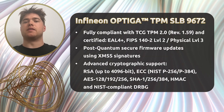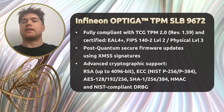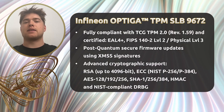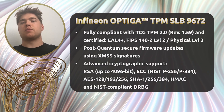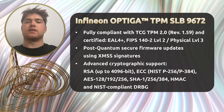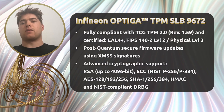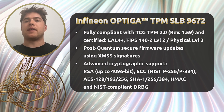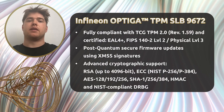In terms of cryptographic capabilities, it supports RSA up to 4096 bits, ECC with NIST curves like P-256 and P-384, AES in 128, 192, and 256-bit modes, multiple SHA hash algorithms, HMAC, key derivation functions, key agreement schemes, and secure random number generation — all in compliance with NIST and RFC standards. It interfaces over SPI with data rates up to around 33 MHz, making it easy to integrate into PC-like platforms, including the Raspberry Pi.